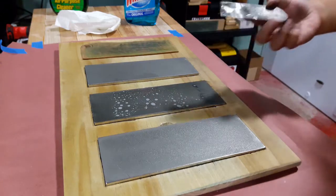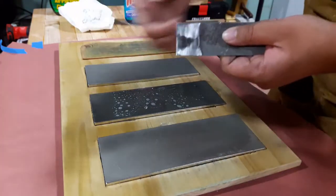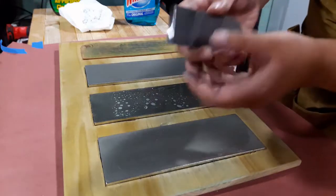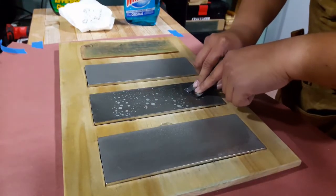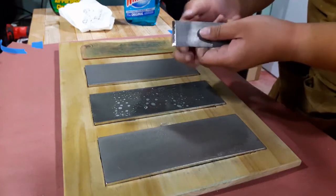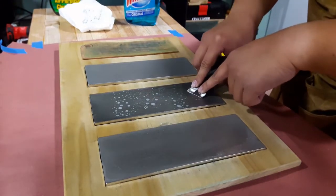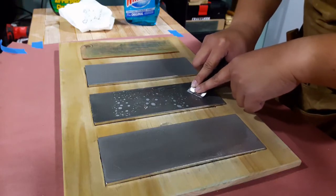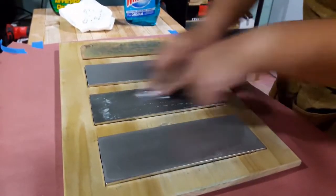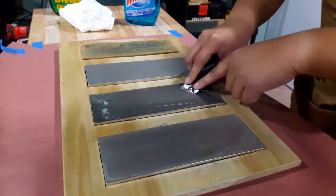Yeah, there's some water tension there, so that was quick - it was flat. You really only need about an inch to an inch and a half of the back to be flat. So now we're gonna try to grind out some of those nicks. We're gonna rock the iron back and forth until you feel the bevel register. Part of the reason why I only do a primary bevel is because it's easier to sharpen that way - there's less stuff to worry about, like whether this is the primary or secondary bevel I'm feeling when I rock the iron. I like to keep it at an angle; it helps me stay more consistent, especially as I work across the iron. If I have to do a lot of grinding, I'll actually do the figure-eight pattern, and keeping it at an angle helps me keep it on the plate.